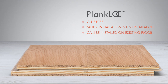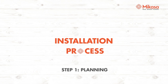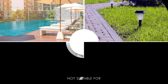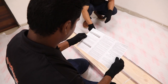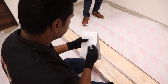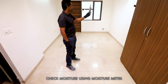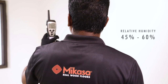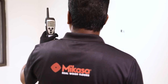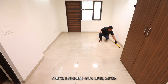Mikasa floors can be installed on top of most existing floors. The installation is easy — begin with proper planning. These floors are meant for dry indoor spaces and not for wet rooms such as bathrooms, laundry rooms, and outdoors. Read the instruction manual carefully and use the installation checklist as a guideline. Check the moisture content of the environment using a moisture meter; relative humidity should be between 45 to 60%, and the moisture content of the subfloor should not be more than 4%.